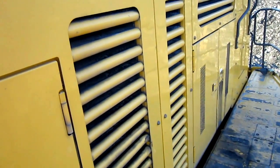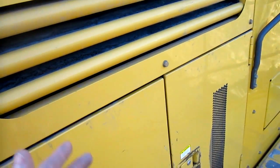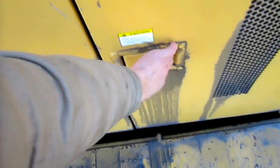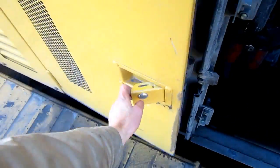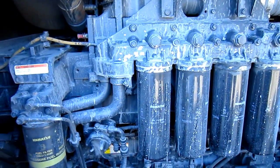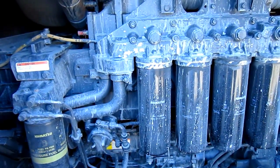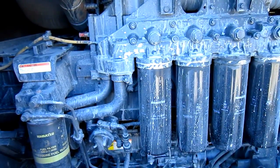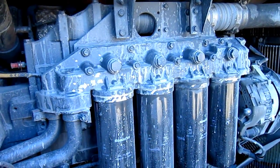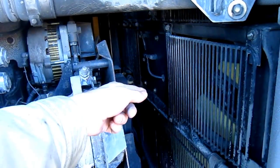The PC-2000 featured a completely different power system setup. One of the biggest changes made to this machine — the older PC-1800 was a twin-engine machine, while this machine was designed to be a single-engine machine. The machine is powered by a V-12 Komatsu diesel engine with a 5.5% increase in horsepower over the older PC-1800. The engine is a model SAA-12V-140E, equipped with a high-efficiency turbocharger with a large air-to-air aftercooler that delivers 956 horsepower. The engine is EPA-certified and from the factory is set to run at 1,800 RPM. The radiator fan is hydraulically driven, which eliminates the use of a belt.